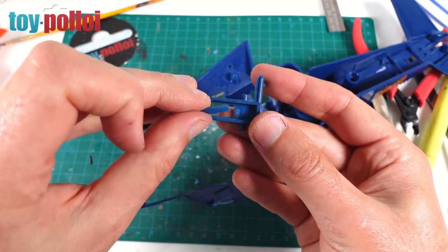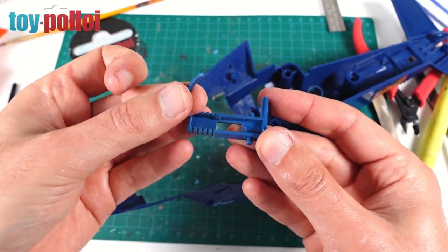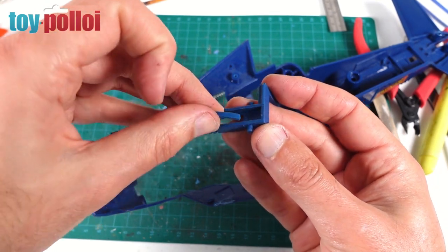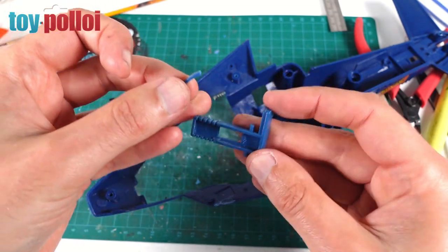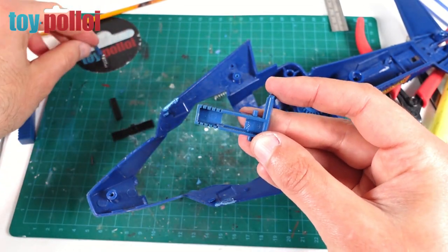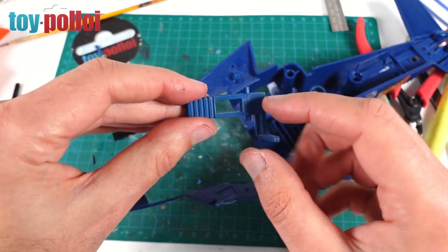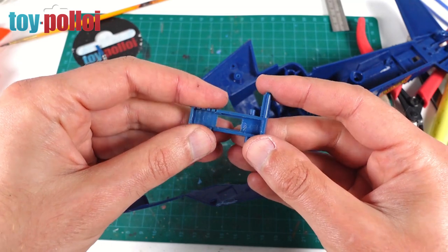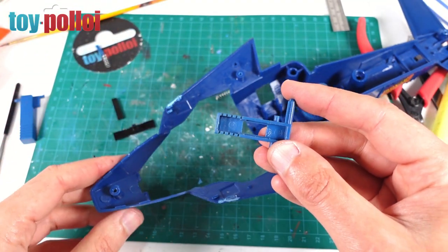So what we're going to do to replace this little broken spring, as you can see, it's a piece of curved plastic that was cast into this button. So as you pushed it down, that flexed a bit. Over the years, this plastic has got brittle and you can see that snapped off. This seems to be a very common problem with the Switchblade. All of these seem to be broken, and if they're not broken now, they will break in future. So my plan is to actually replace it with a spring.